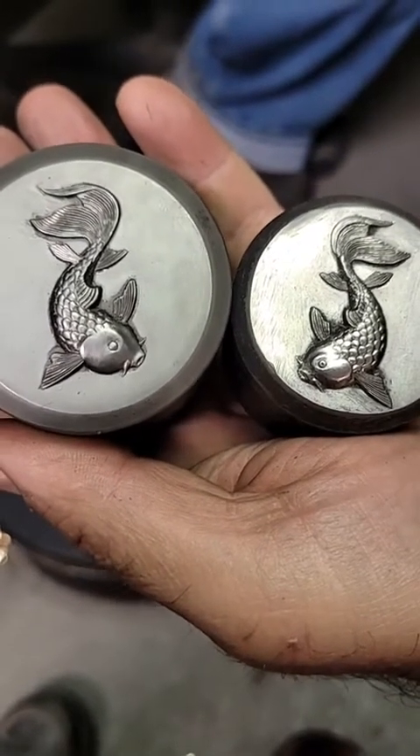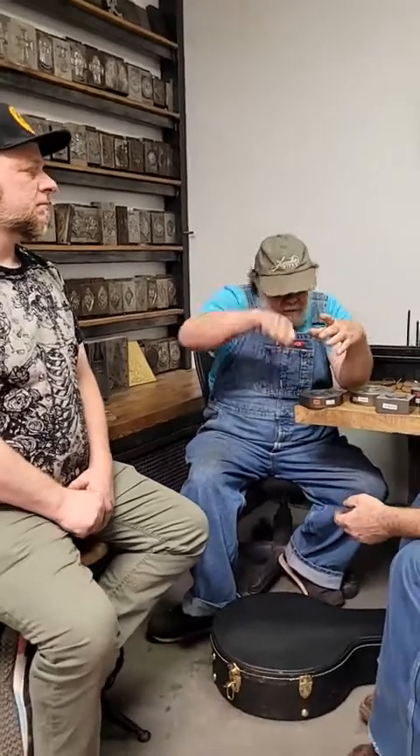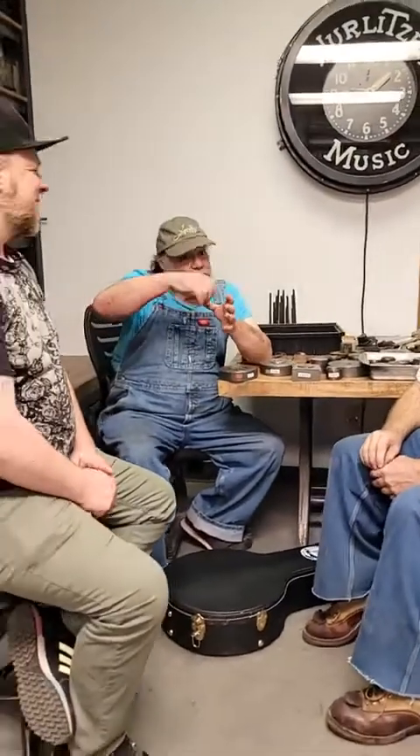They're cut just how you'd imagine — no trickery, just lots of work. He doesn't use a hammer though; he uses an air-powered engraver. He pushed by hand for years, then got into a Lindsey palm-control engraver — Steve Lindsey makes it, it's the Rolls Royce of air-powered engraving. Everything's right within the handle, no foot pedal. It works just like push gravers except it's got a little jackhammer inside. You can adjust the power and number of strokes.